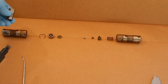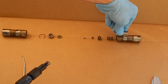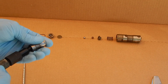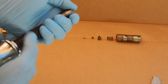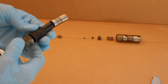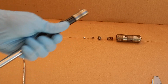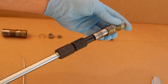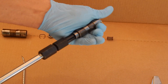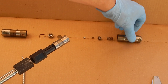In order to get this apart, it fits down in here once you get these three pieces off. This is stuck in here — it will be a son of a bitch getting out of there. So you stick that in here like this, get this in here, it fits in there, then you tighten this down and expand that collet. Then you can slide hammer this piece out of here because it's a real tight fit — you hold this and go like this, just like that, it comes right out. It works sweet.